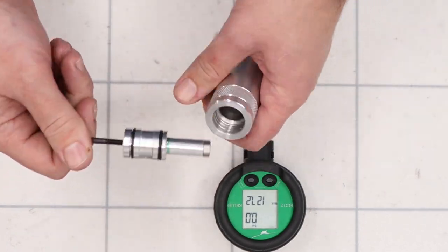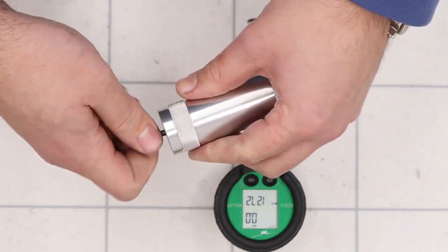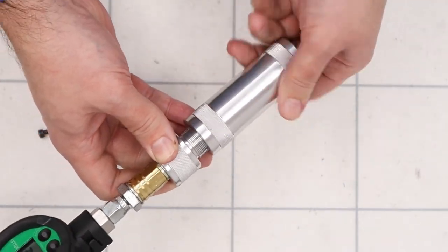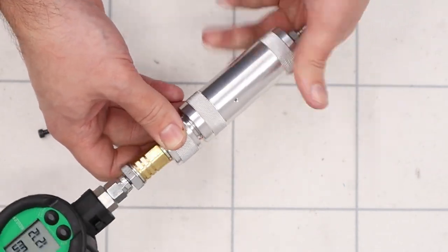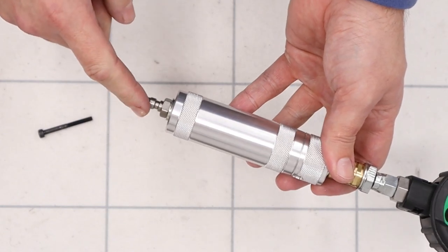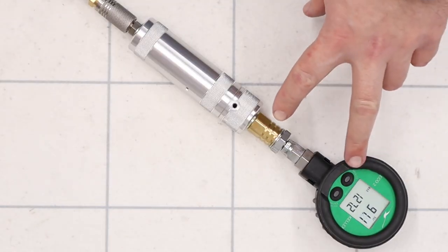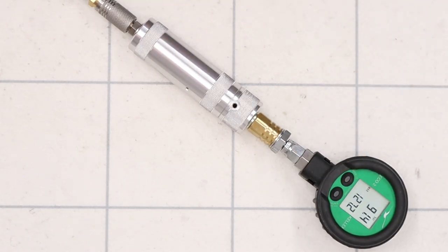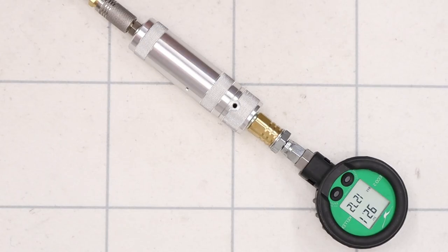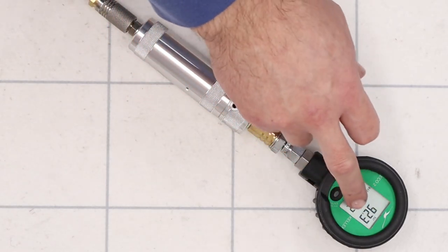We'll put the reg in the reg tester and see what happens. Just use a screw in the back of the regulator to make it a little easier to handle, push that in the back. I put a small amount of silicone grease on the O-rings before we started. Screw the two halves together and then hook up our pressure to this side. With the pressure connected you can see the regulator pressure building up — we've got about 91 bar at the moment and that's what the regulator from the factory had written on the side. I did put it back to the measurement we took as we disassembled it and lined up the alignment marks, so we're roughly at where the factory set the regulator.